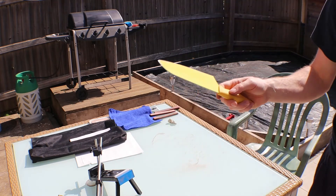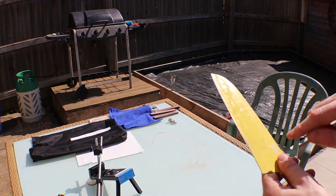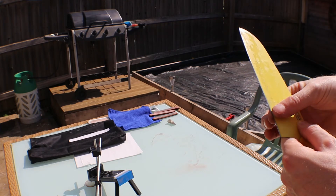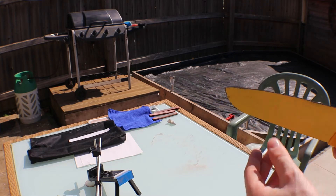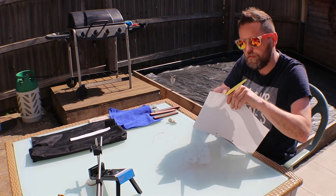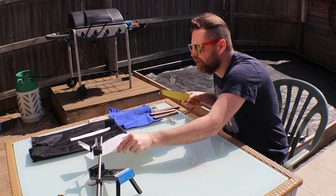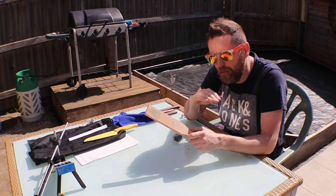You can see all the bits that aren't yellow - these are from previous knife sharpeners, and I actually sharpened this on an angle grinder a couple of times as well. This damage is from the previous knife sharpeners; you can see how high they come up on the blade, which isn't what we want. We want our sharpening across the edge. We could re-profile this all the way back up to the plunge line but we're not going to do that right now. It does feel much more fine and clean - that cut is all the way to the end pretty much, though the end could definitely do with some more work.